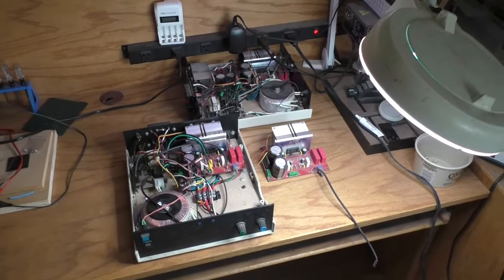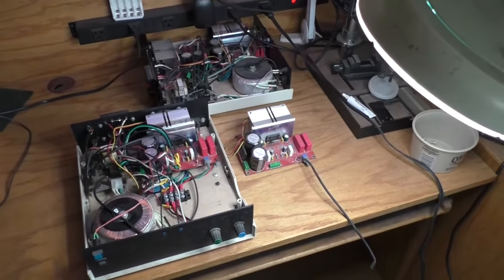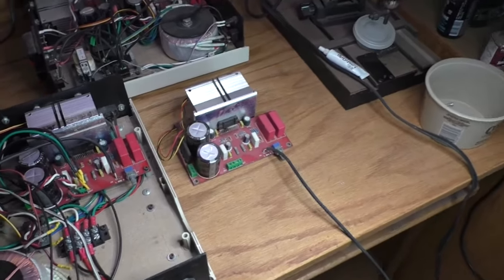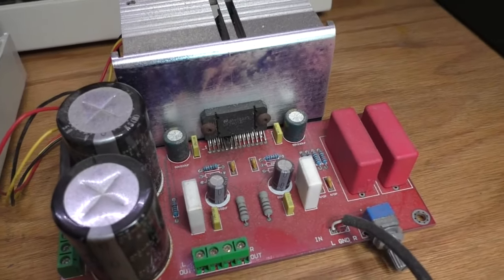Now I have the 2 amplifiers on the bench and I have already pulled off one of the modules. Zooming in closer, we can see a black scorch mark on the leads to the chip that resulted from the power surge. This system is powered by 120 volts AC and surges measured during the event were between 200 and 300 volts.